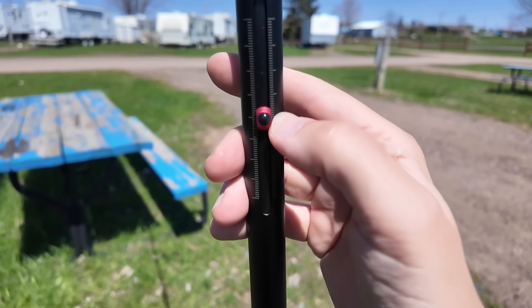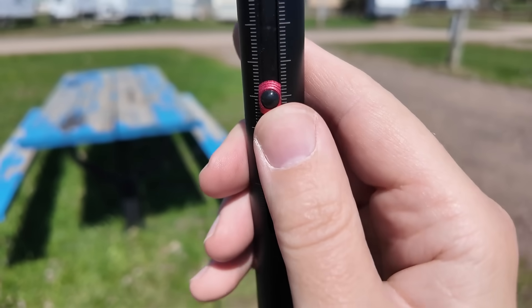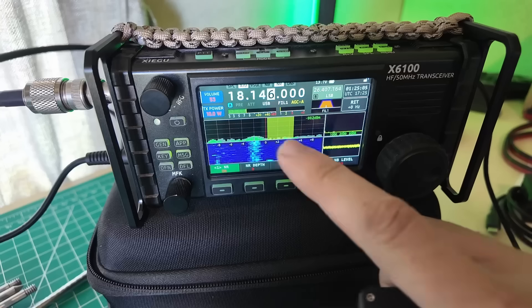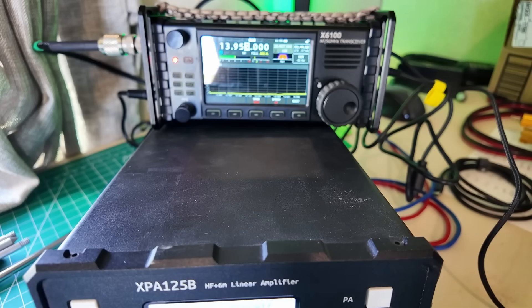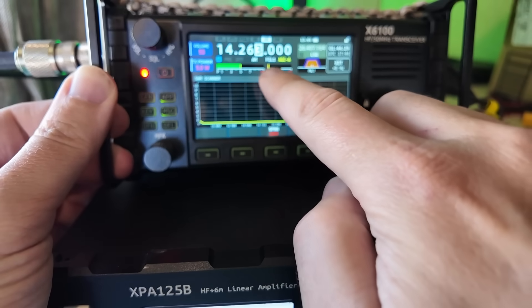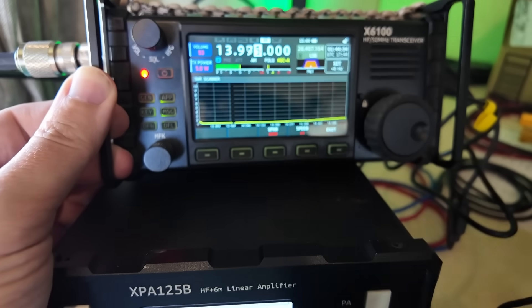I'm going to go up. There are markings here — they look like half-inch markings, probably metric since this is not an imperial antenna. I'm going to go up halfway between those two markings. These things are what you call high Q, so a little tiny movement makes a big difference in where you end up on your SWR scan. On this radio the SWR meter is right here, so we'll watch that while we're making this contact. I just got it retuned for the 20 meter band. We are pretty close to one to one all the way across — never gets above 1.7 to one. Awesome.